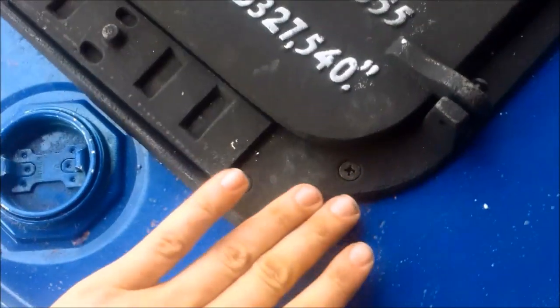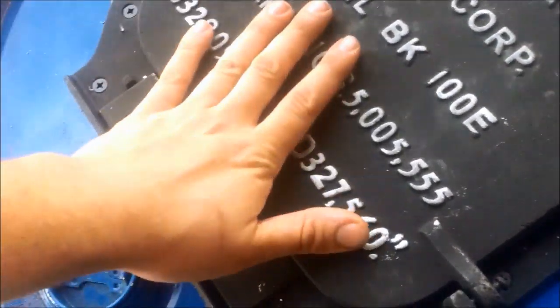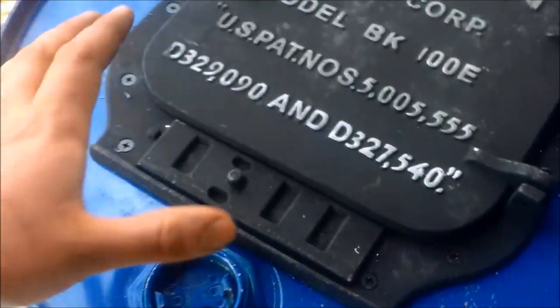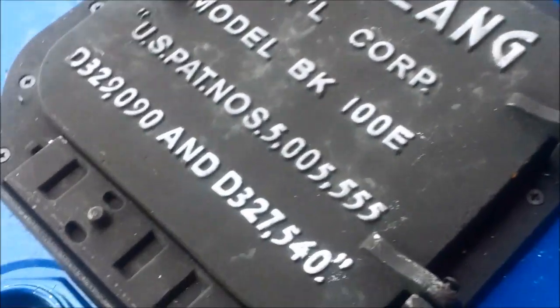Alright, the door has been installed. It's just that easy. Bolts. This is cast iron. And so next we're going to put the feet on. Simply what we're going to do is sit it down with the feet just holding it, not bolted in place yet. And then we're going to adjust it and make it level. And when it looks level, we'll mark it and drill those holes.